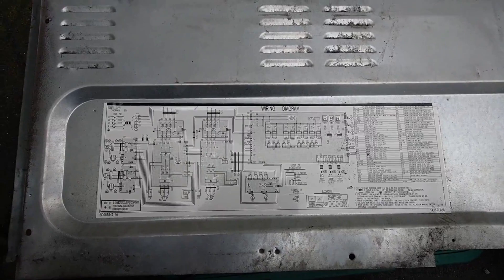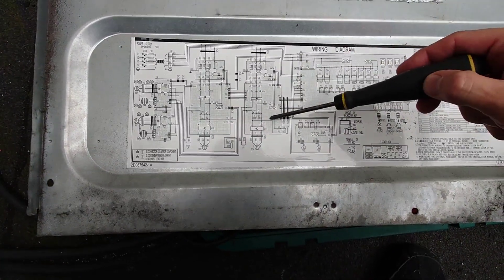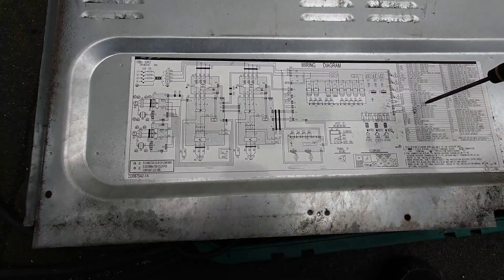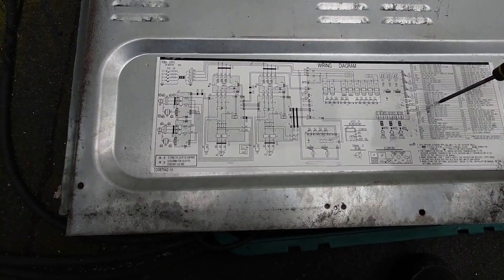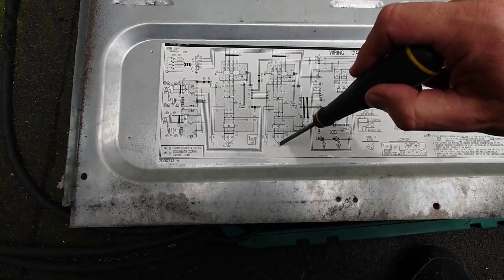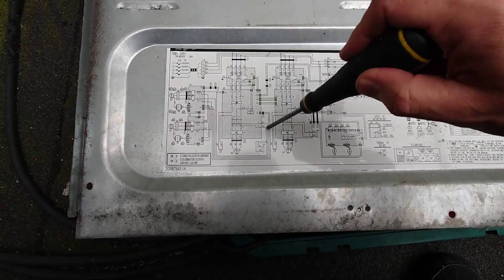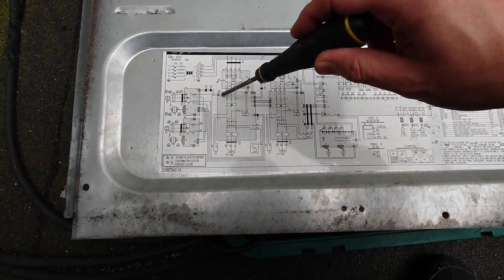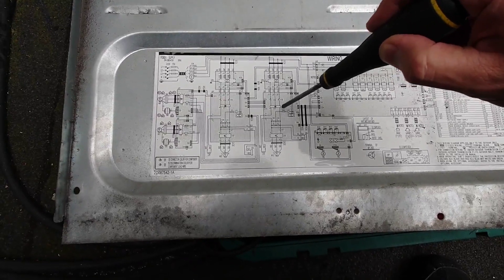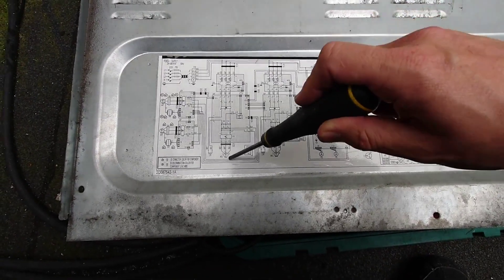There's your wiring diagram on the inside of the top panel if you're interested. You've got your two power boards and your two inverter boards connected to the two compressors. Although it does say compressor one and compressor two on here, the key doesn't indicate whether it's on the left or right-hand side, so the easiest way to determine which board you're changing is to follow the cable back from the inverter board to the compressor. You need to make sure you've got the right one — you can see from this drawing that although they look similar there are differences. AS6P is missing on one, the bank of plugs is missing — so they're not the same. It's very important you ensure you've got the right inverter board for the compressor you're changing. The compressors are identical.